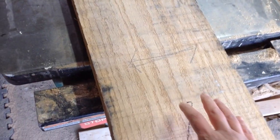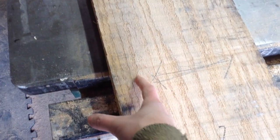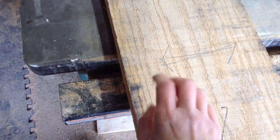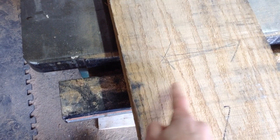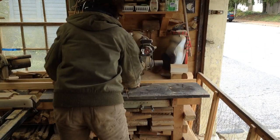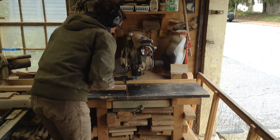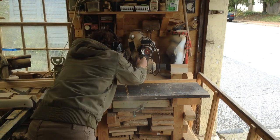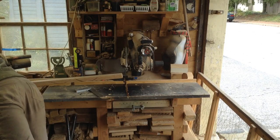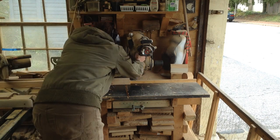I'm going through and putting a frame on the outside. I usually don't love doing this because the outside frame, especially if it's real lumber, is going to move and shift at a different rate than the inside core, which is fairly dimensionally stable because it's made of MDF. To combat that, I took those pieces, cut them down to strips, and turned them on edge, because wood will expand and contract across the grain. So it might get a little bit thicker or thinner, but it shouldn't create gaps along the tabletop.